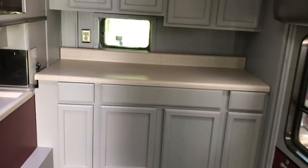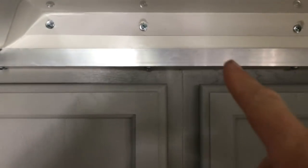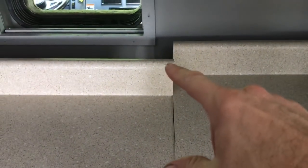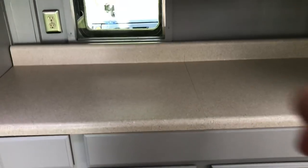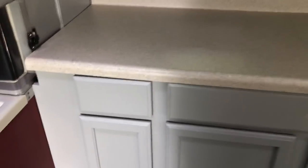Here's the countertop in place. There's always going to be a black line here, and as I pull it out the black line is going to have to get even bigger because it's not a perfectly straight line. So I had an idea — I've got this aluminum trim piece. I can get a thin aluminum strip, and when in doubt, it's best not to hide things like this but to accent them. I'll bend it to fit and attach it to the left piece so it will curve around and have a nice edge. When you close it back up, it'll slide with the left piece and cover up the whole gap.